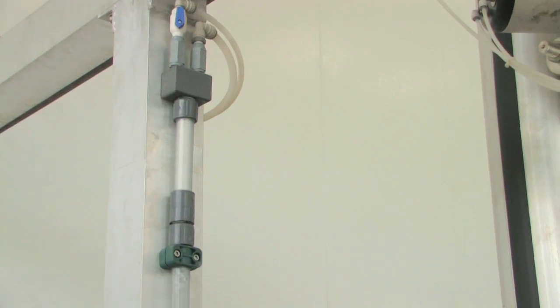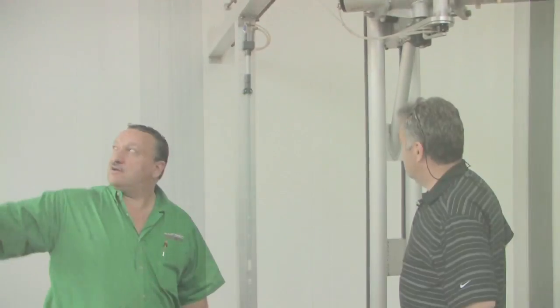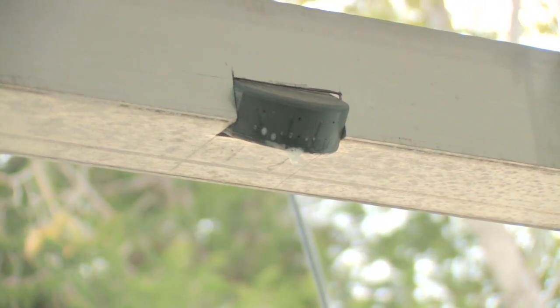Ralph, do you have any problem, as you apply your chemical, with a lot of side wheels spinning here? Do you think you get a lot of rinse off with that? Is that the purpose of going hotter, hotter, and then hottest closest to your high pressure? Yeah, and in addition to that, Fred, we've got multiple applications. Behind us, you'll see there's another foaming tube to apply a pre-soak again. There's also a gray nozzle right there in the middle, if you can see it.